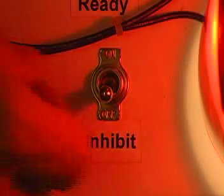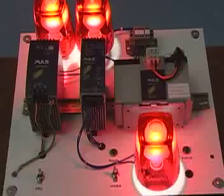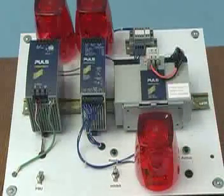To demonstrate this, I will flip the switch, applying the proper voltage to the inhibit circuit. If the AC power is removed, the control unit shuts the load down instantaneously with no buffering.